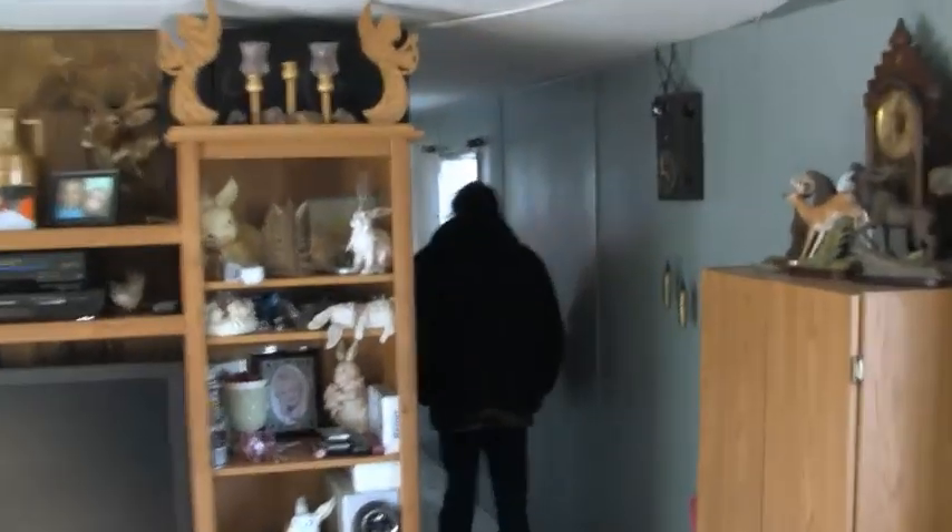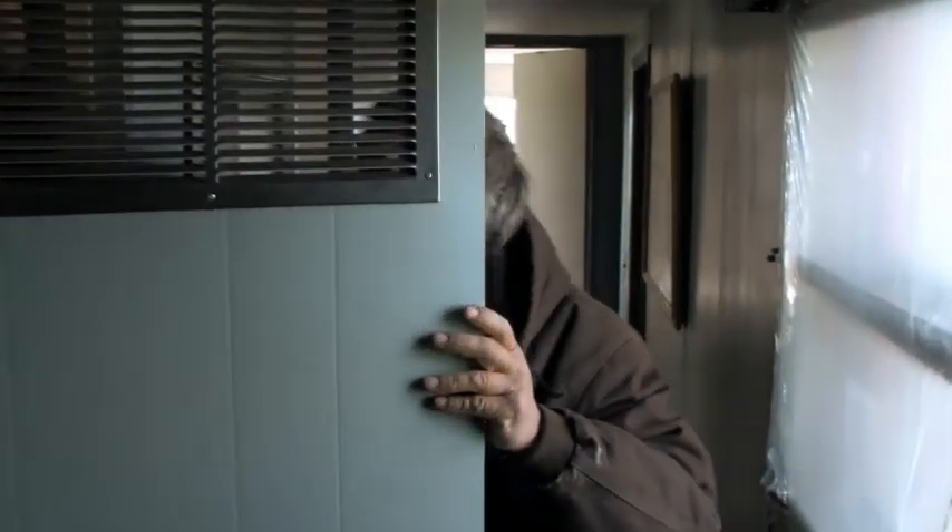Right now we're doing our initial blower door test, and during that test what we do is walk around the mobile home and look for areas where insulation can get into the mobile home. At this point we aren't so much worried about air sealing techniques — we just want to make sure that we don't fill up furnace closets or underneath bathroom sinks. That's where some of the bigger holes are. What we've found is that during our insulation techniques, we do get a considerable amount of reduction in air sealing. So we do not do any air sealing until all of our techniques are done — attic, walls, and belly.